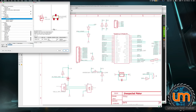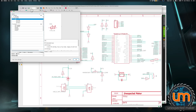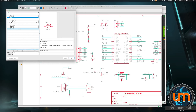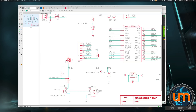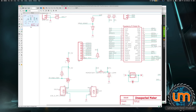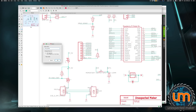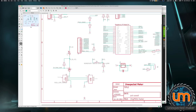Now I also need to add a PTC. I have some poly fuse resettable parts, but I'm not sure the ones I have are rated to 500 milliamps — I'll have to double check. I want something that can do at least 500 milliamps, and I'm assuming I can get one in a 1206 package. For right now I'll use a 1206 package anyway. I'll name the net after the PTC '5V PTC' so it's clear that's after the fuse, giving me basic current protection.